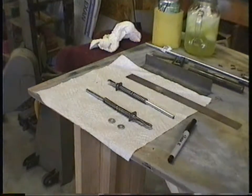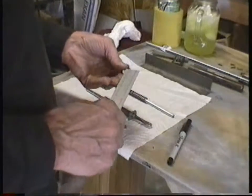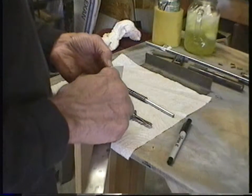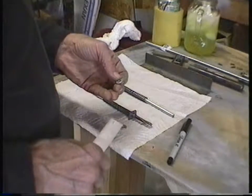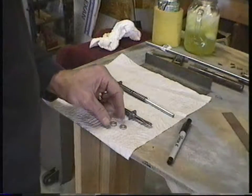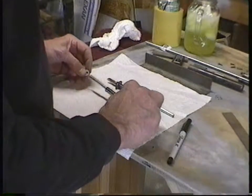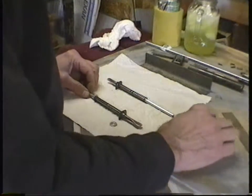Okay, after all that digging, I did find the two perfect washers, half inch in diameter. Well, a little more than a half inch. Let's see what they are. They are 9/16 in diameter, 1/4 inch opening, about 50 thousandths thick, absolutely perfect. Now, I've got to arbitrarily set the butt depth here. This washer welds on. Now, I've got to figure out how much depth I want that.